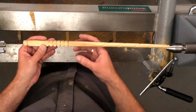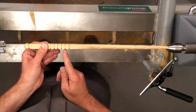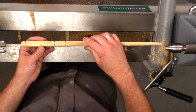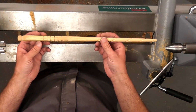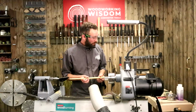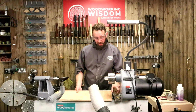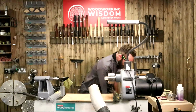So if we just come overhead, that's lovely. So you could put a little wedge in this and just scorch the surface through friction. Okay, and that'll really define all of this. But I love pyro, so I would take this across and use my little pyrography pen to get that just right. Okay. So I just wanted to show you some other examples and perhaps talk through different ways you could do this. I've made a few in my time.